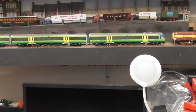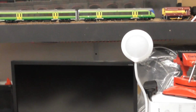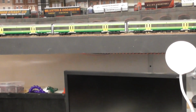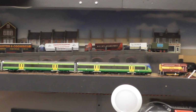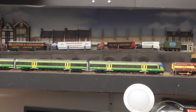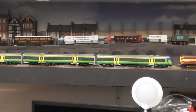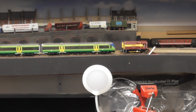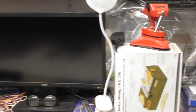I actually put a 15-way D connector on each one of the relay boxes, and now I plugged them in, and the one up the end of the room that I showed you last was faulty. There was a faulty relay board in it. It had 2 pins on a jumper wire that weren't soldered. Don't know how it ever got tested, but anyway, that's fixed now.